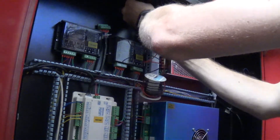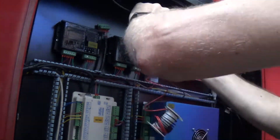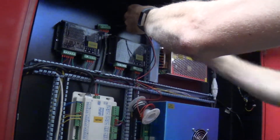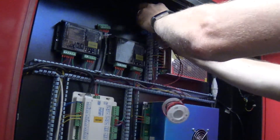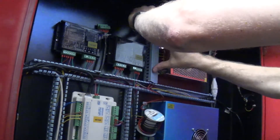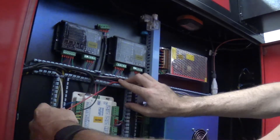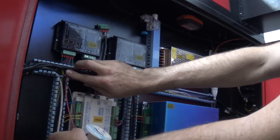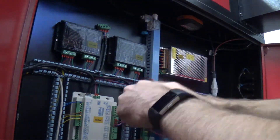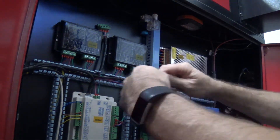Here I am back at the laser cutter with the electronics exposed on the side panel of the cabinet. I'm going to cut this air supply line that runs through this portion of the cabinet, which is very convenient. I'll take a pair of diagonal cutters, snip that line in half, and then use the quick-disconnect air fittings to put the solenoid valve in line. Then I'm going to open up these chases and run the black and red wire down to my laser cutter control board — that's the white board. I'll fish them over, get them the right length, and snip them to length.